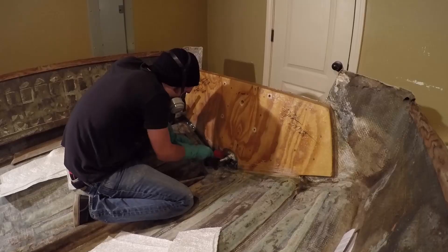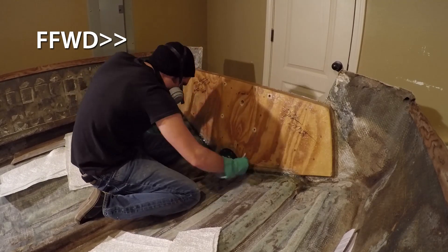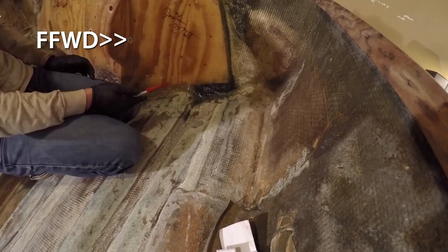While that was curing, I mixed up a batch of fiberglass putty, filled the void, let that kick off, took the thread out, and then ground down the pipe flush with the putty. I don't have footage of the grinding to show you because my files were lost from the camera — shooting digital, that can happen. What I can show you is making the next round of putty, doing my fillets, and finishing off that little void and the fillets along the side of the transom area.